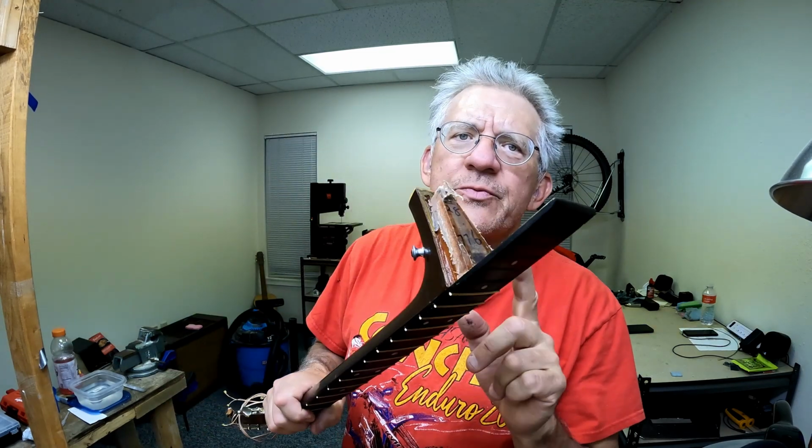It took a long time. That run was in there for an hour, and the heel was hot, and I just didn't like that. Like I said, I was trying to push on them. I actually ended up taking it out of my table jig and wiggling it by hand the old-fashioned way to get it loose. I couldn't use my little jig, which I have in another video, the neck press jig. Go look at that. On this guitar that I just did, I put it in the neck press jig and it took 5 minutes, and I was getting a little too much water, so I pulled the needle off, and when I pulled the needle off, the neck came off with it.